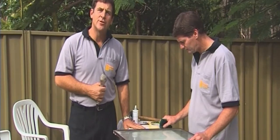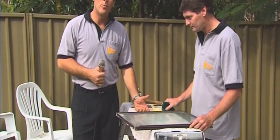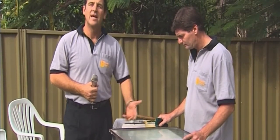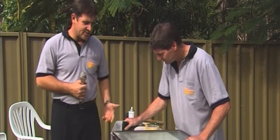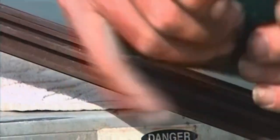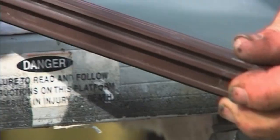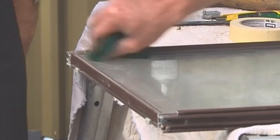Let's move on now to the surface preparation so we can get paint to stick to it. Anyone could put paint on, but we want to put it on so it stays on — you don't want to be getting called back in two months or three months or four years time. You want a product you're going to be proud of. With the sash here, you'll notice we're just scouring it — we don't have to sand it right back to nothing. The surface is quite good, so it just needs to be keyed up, which means roughing it up a little bit so the edge primer can stick to it.